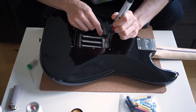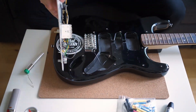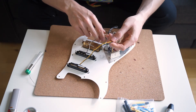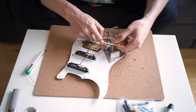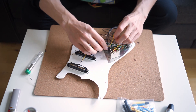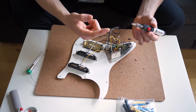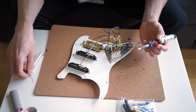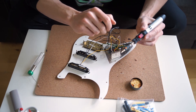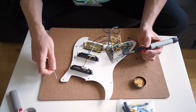I'm going to follow this wiring diagram exactly. I'm removing the ground wire from the spring retainer and from the jack so that those wires can be threaded through the holes and I can remove the pickup. Gas powered soldering irons are annoying — I'd rather not use one, but that's what I have. They're annoying because you have hot air that comes out and burns things, so you always have to make sure it's not facing anything that could burn easily.